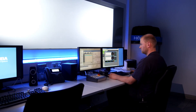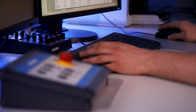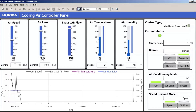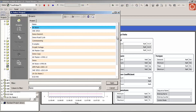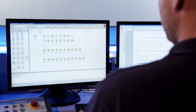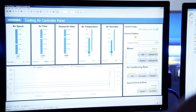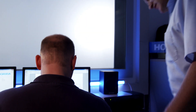STARS brake automation is designed to address a wide range of brake testing applications. STARS reflects Horiba application know-how built over decades as a supplier of advanced brake dynamometers, and features an intuitive user interface. STARS provides brake application suites for easy startup and performing common brake test procedures defined by leading OEMs. The suites include the complete test schedule, required data input, test sequence, data acquisition, online calculations, monitoring, data storage, as well as a report generator powered by National Instruments DIAdem.